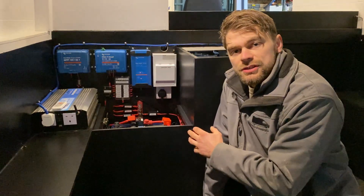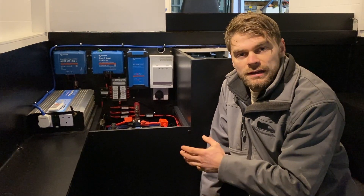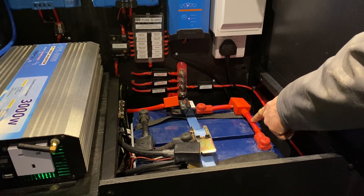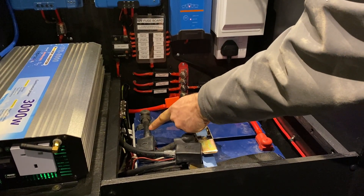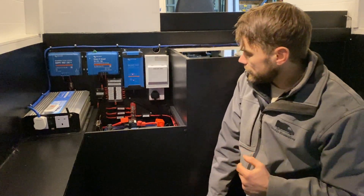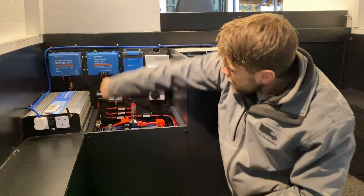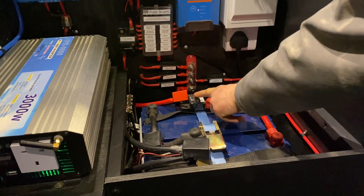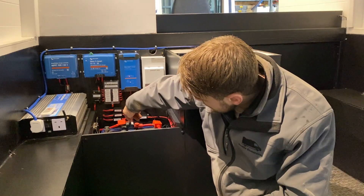As you can see, we've wired these batteries using 50mm flex tri-rated cable. The positive terminals are connected together and the negative terminals are connected together, and this creates a battery bank of 300 amp hours total. If you take a closer look, we can see on the positive terminals I've put this main fuse which is rated at 200 amps, and this is resettable by pressing this red button here.